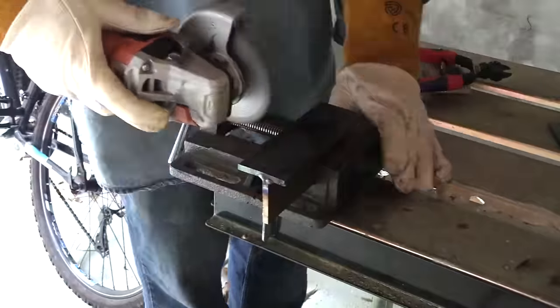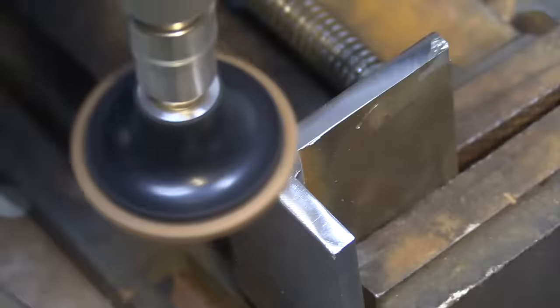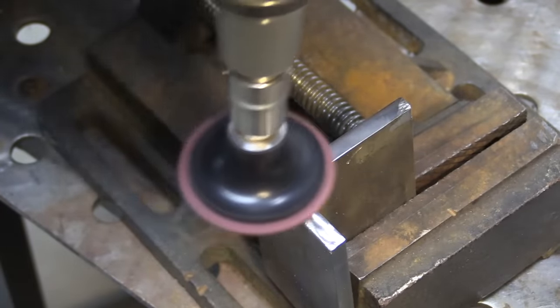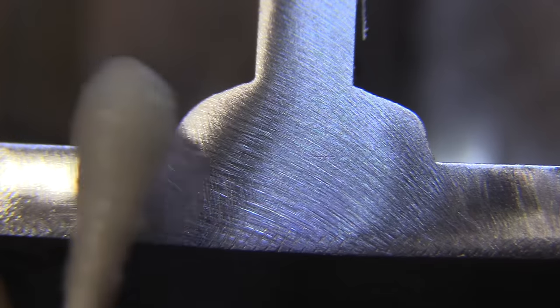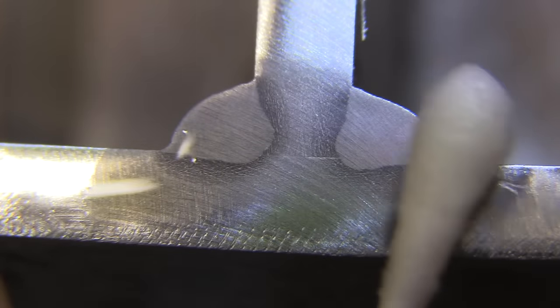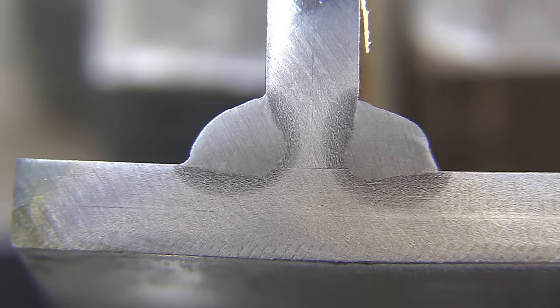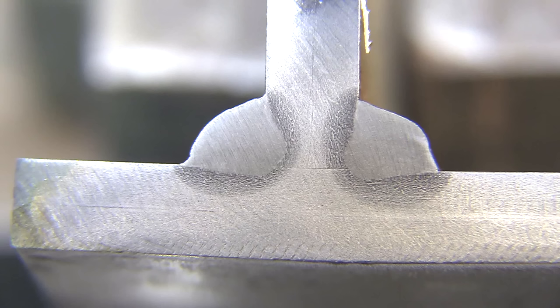The pull's done. Now let it cool completely and cross-section it — do one cut and etch in the middle here. I polished it with a brown Scotch-Brite followed by a red Scotch-Brite Roloc disc, and then I used a little etch that's basically a passivation solution for stainless steel — that just happens to be what I have on hand. You can see there are some slight minor differences, but not like night and day. Both of them got in there; there are minor differences.